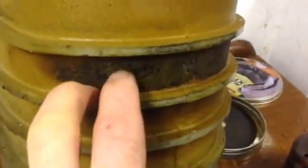I'm actually looking at this one and I'm not sure why it got taken out. You can see some sort of pitting and corrosion going on here, but that won't have affected the operation of the boiler. We can see a bit of discolouration — it's getting quite hot in here — but that's to be expected, because that's probably about the hottest place, down where the first fingers of the heat exchanger come across.